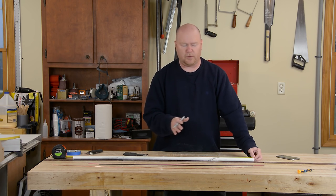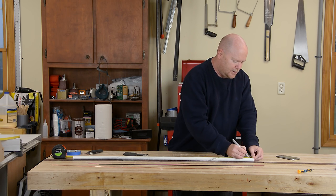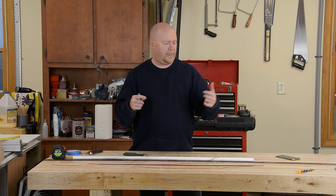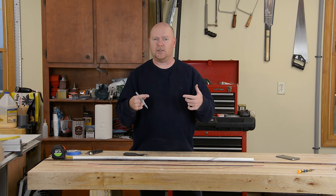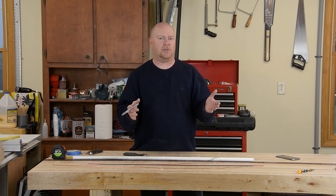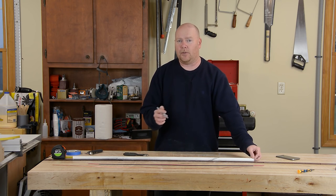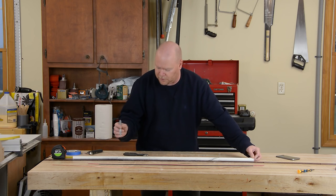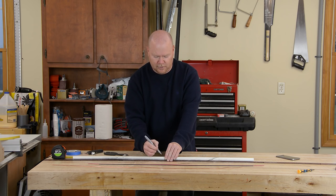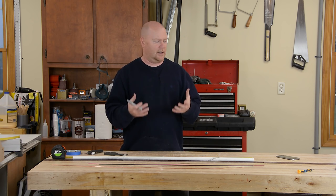Next step is to mark the boom for where the antenna elements go. The director essentially goes at the very front of the antenna — I'm going to mark it one inch back in just to leave room for my fastening system. The plans, which I'll link in the description below, actually make this antenna out of two 18 inch sections of PVC attached with a T in the middle, making the entire length 36 and a half to 36 and three quarters inches depending on the dimensions of that T. I'm going to go 36 and a half back from where I marked the director, then 16 inches forward from that for where the driven elements go. That spacing is not super critical, but the closer you can get it the better.